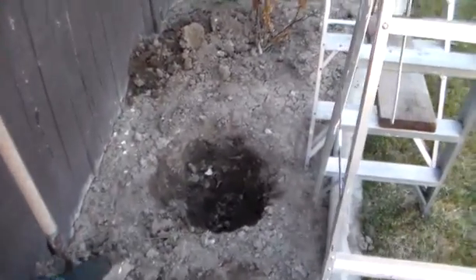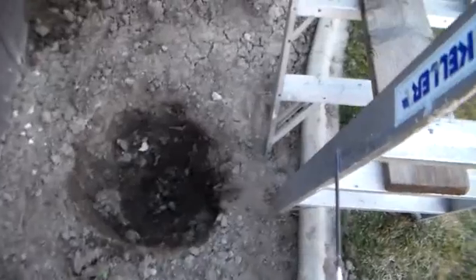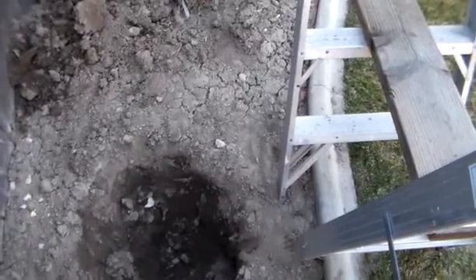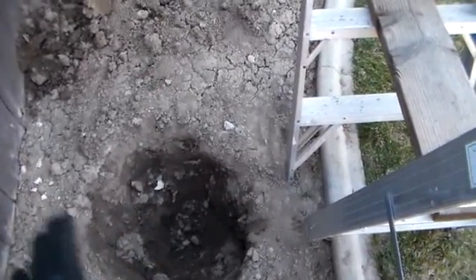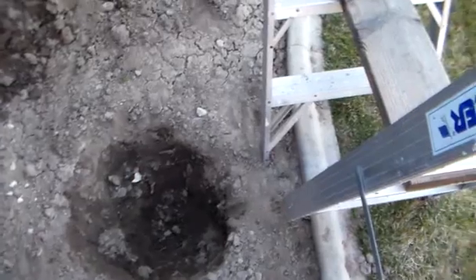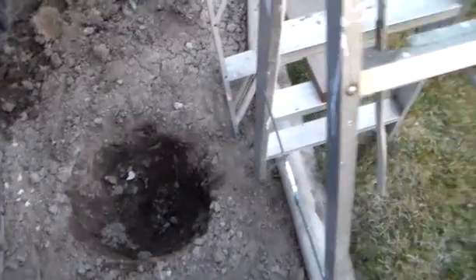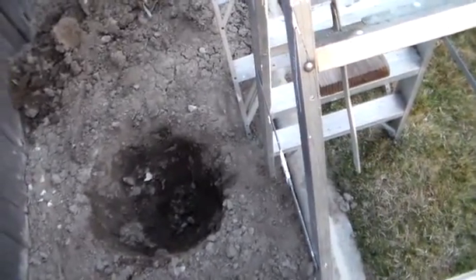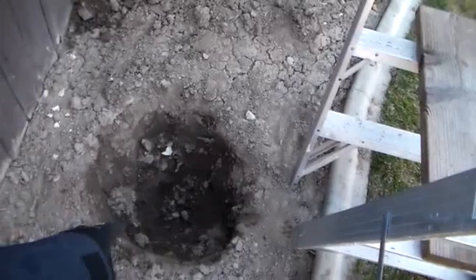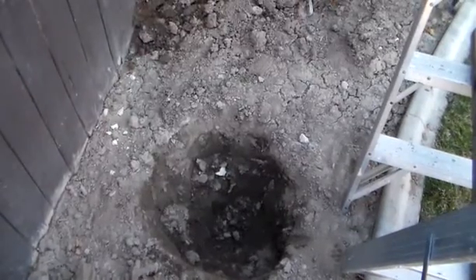It starts with just a small hole to get started. What I wanted to do is bury the base of our well down there so it's not showing, in case we decide we're not going to use it — like if it's just for an emergency thing. It'll be kind of under the ground, hidden. Like how your sprinklers pop up when they go on but you don't want them up all the time. When we're done, we'll seal the well down there with probably cement or bentonite.